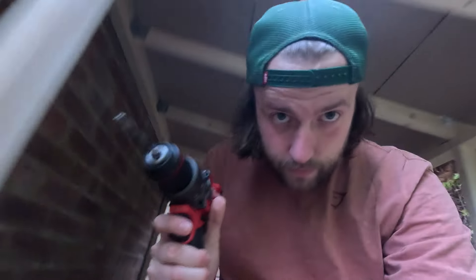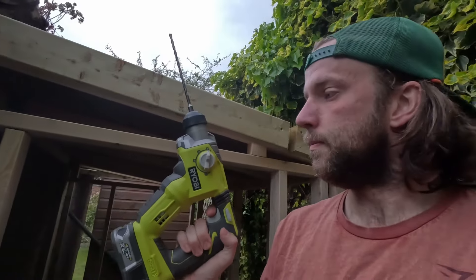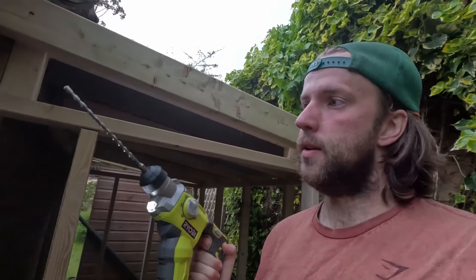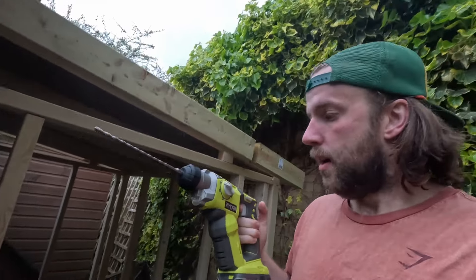And after having to go with my hammer drill, which is a great tool but is no match for this concrete, I mentioned at work that I did some Googling and I needed something called an SDS drill. One of my coworkers just turned up with one today, which for a design agency that builds websites is definitely a unique bring to work. So I've now got myself an SDS drill, currently on hammer mode, with a six mil masonry drill bit which is long enough for it.